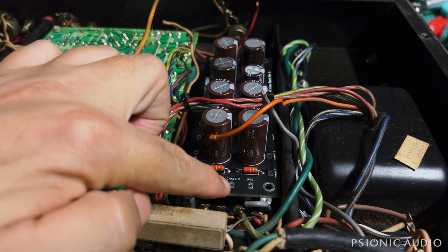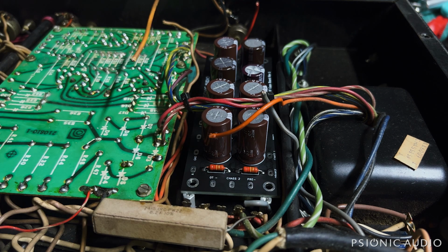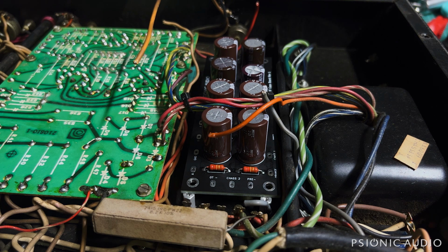While these wire holes may look very small, not these large ones for the screws, but these here, these are all 1.5 millimeter, which is larger than an 18 gauge wire goes into. None of the wires in this amp are anything larger than 18 gauge. Most of them are 20 and 22 gauge, so it won't be an issue. But I think on later ones I might make these accept up to 16 gauge just to give a little extra wiggle room. You don't want too much, because then you have a whole bunch of solder and things are just kind of floating around in a joint. But you don't want it too tight, because sometimes old stranded wires don't like to go in there. I shouldn't have any issues.